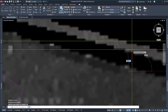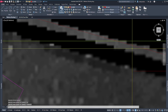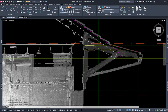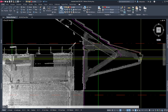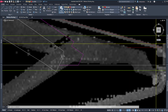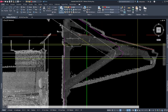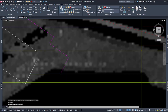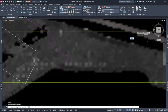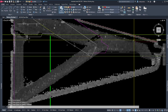So I'm going to come up. I hit 2 and 13/16. So I had a 3/12 set up for this. And, you know, there's obviously some give and take through this. There's some push up here, pull down here. So we're going to call this a 3/12. So all I'm going to do is go ahead and draw this line up. And I'm going to say 3. So there's my new pitch.